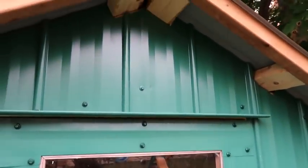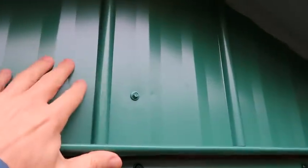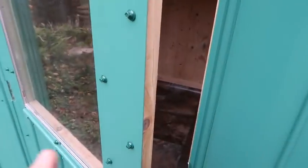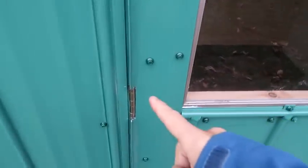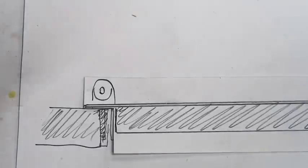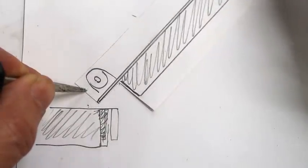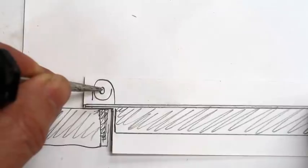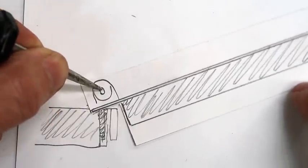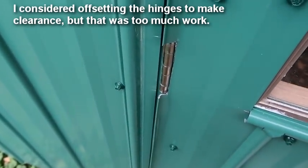All that is actually a little bit redundant because this is very close to the eaves, so I don't expect too much rain to hit the wall right here. This lip sticking over the doorframe is actually what closes it against the sheet metal, but I screwed up with too much overhang on the left side because that ends up hitting the wall. This would be fine as long as the door pivot is left of the end of the flashing, but my hinge is right here, so when it opens the flashing ends up hitting the wall — which is why I bent it back a little bit, just to allow the door to open a little bit further.